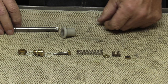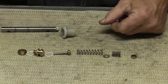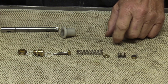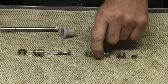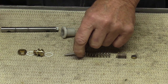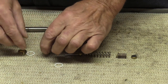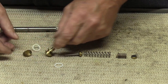For this particular rebuild, we're using the traditional check valve. I'm out of the Mac1 synthetic ones, so we're going to use this check valve spring, the washer that goes on top of it. I put a new exhaust valve spring in because the old one was kind of funky — all green and rusty-looking. And we have a new exhaust valve stem. This is one of the Mac1 seals that goes on the bottom of the exhaust valve, another one goes on the top, and then our nut. So let's put it together.